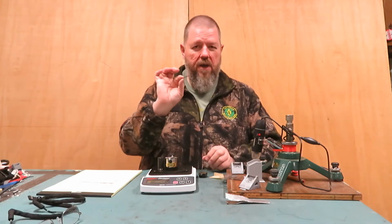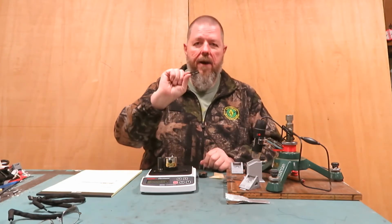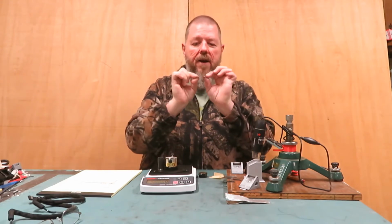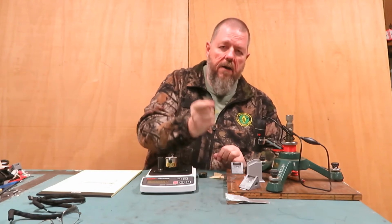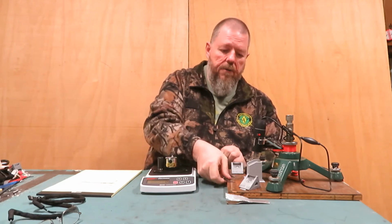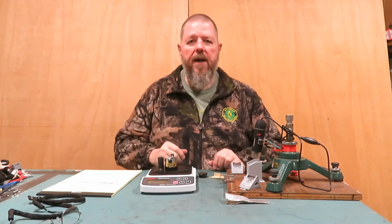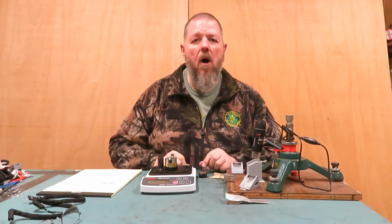Now, this blade is 40 thousandths thick. If I look at a razor blade, that's 1/4 of that. That's 0.01 thick, right? It's about as thick as a piece of paper. The same thing with the box cutter, also very thin, not very durable. Havilon's a little bit thicker, but we wouldn't hunt with any of those three blades. They're just not durable enough. So there's sharp and there's durable, and I'll be doing some durability stuff later on.